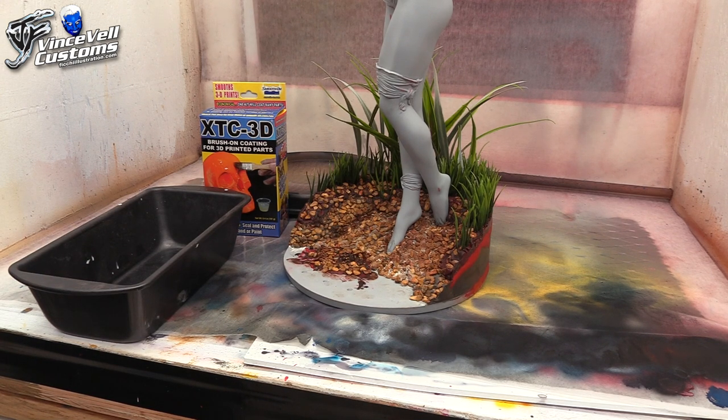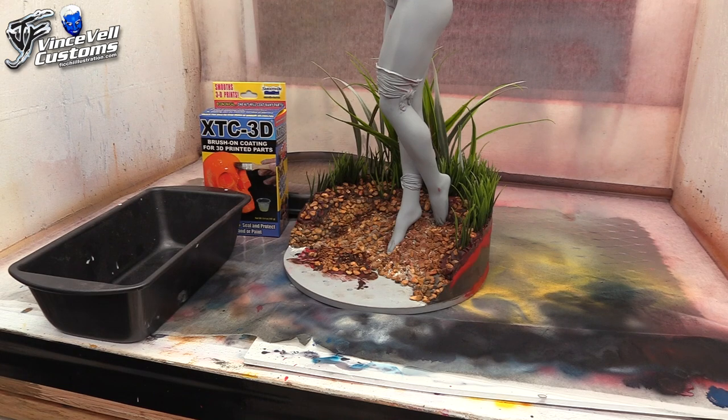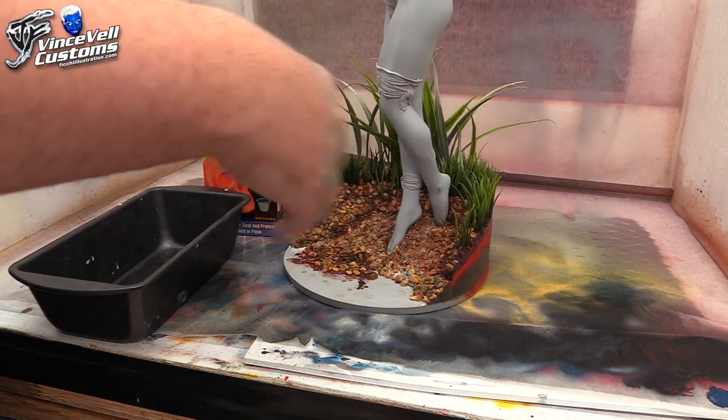Now, there is only one issue with the clear resin. It is the middle of winter. I will have to use the vacuum chamber to get all the bubbles out and degas the clear resin before I mix it together. Instead of doing the vacuum chamber in the studio, because you're taking the fumes out into the studio anyway, I have to heat up the garage and do it in there, and then I'm going to do my pour in here.